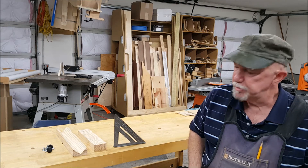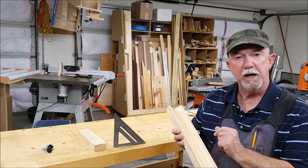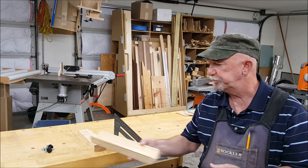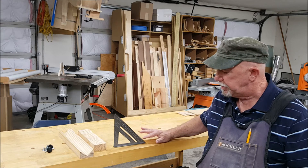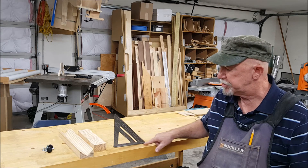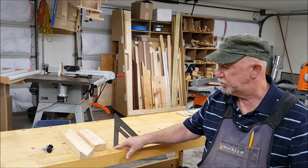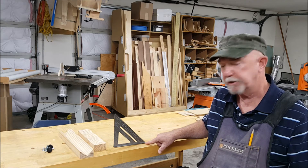The reason we care about this is because we want to cut a groove down the middle of a piece of wood, and we want to come in from both sides and have the saw blade meet in the middle — not leave part of it hanging like you saw earlier in the video. Imagine that this is your saw blade tilted at 45 degrees. Remember that these two sides are the same length, so you can take the measurement — the distance from here down to the tabletop — and that is going to be the same distance from the point of the cut back to the edge of the blade where it comes up out of the table.